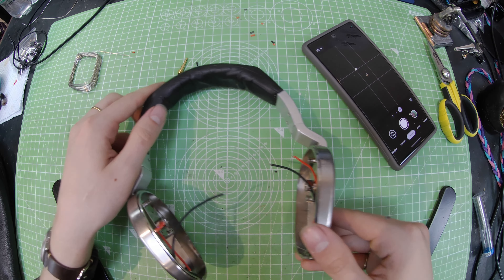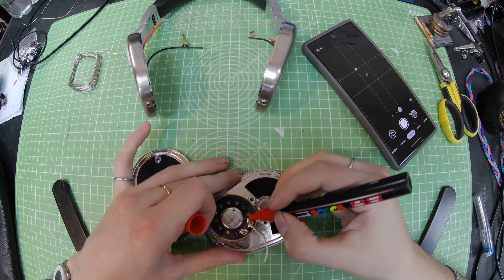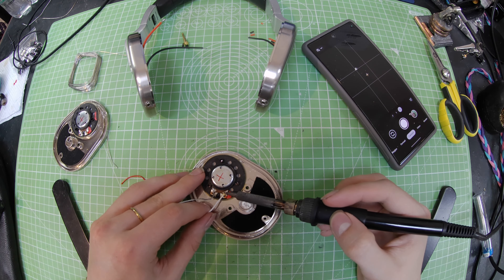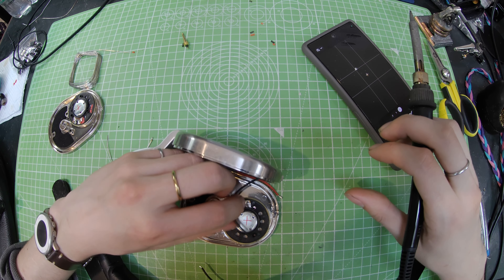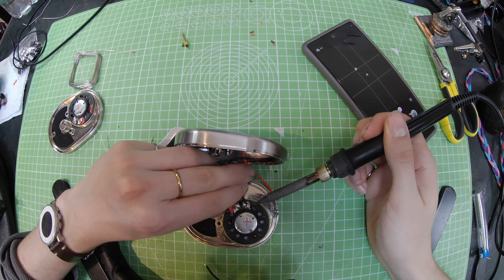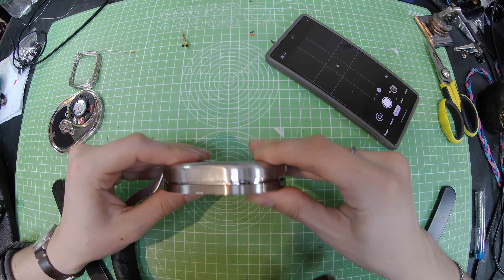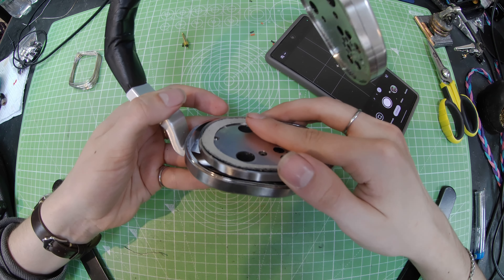And here they are all ready to go. That little piece of felt they've got there always reminded me of the Wu-Tang Clan logo the whole time I was working on it. So there we go — I'm whipping off the original wires, that's always a tough bit because if you heat them up too much then the original coil wires are broken and there's nothing you can do after that. That's the end of your £700 pair of headphones right there. So that's one side done and I'm just going to move on to the other side, soldering those wires on, get it all connected on the inside.